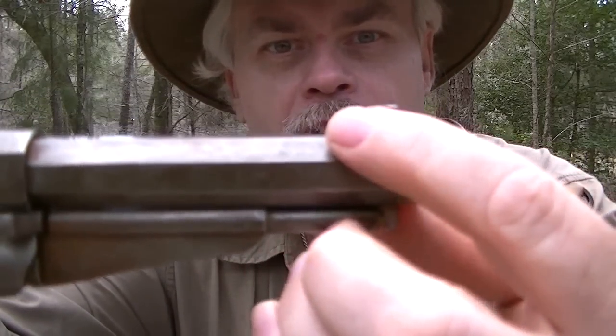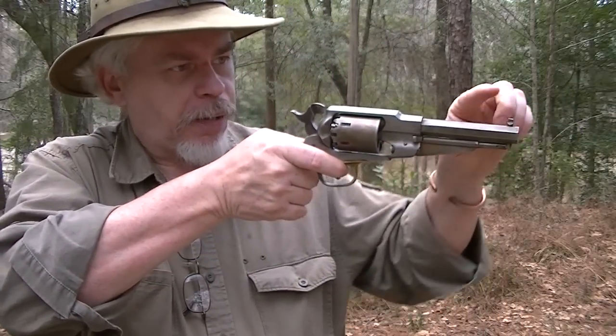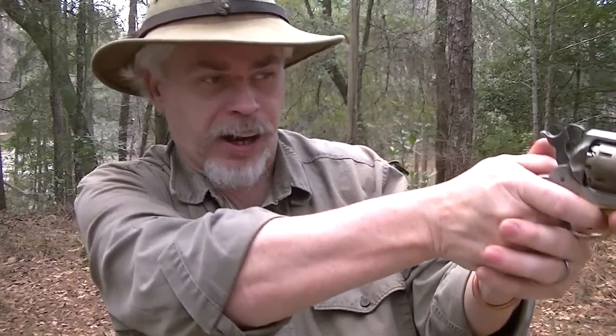What I've done is I have squared this off sharply with a file — not removing much metal, but just making it a 90-degree edge. And then on the rear sight back facing me, I have undercut it just so slightly. This puts my front sight a little in shadow from most shooting. Otherwise I would come up to shoot and may have a glare off of it, or the sunlight's hitting and it's bright. By undercutting it ever so slightly, I directed that downward and don't get that glare back. So when I line up and look at my sight, I get a clearer sight picture.